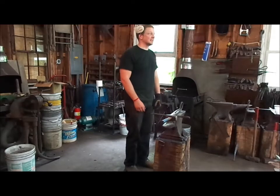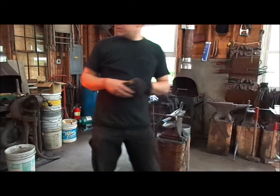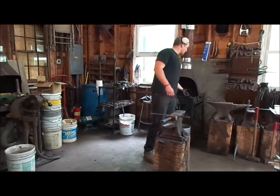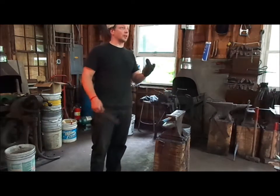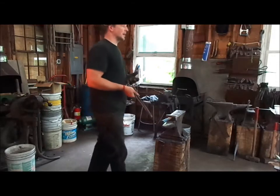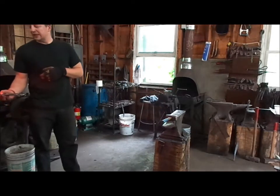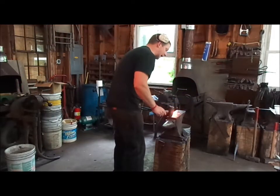Any more questions? When you say heat treating it properly — does that mean keeping it at the right temperature? Well, with something like wootz or other crucible steels, you do need to be careful about your temperature control during the forging process. Matt was running pretty hot just to make sure he wasn't stressing his welds too much. If you have what we'd refer to as a monosteel — say a piece of 1084, 5160, O1, or whatever — generally speaking you don't want to get the material too hot and very definitely don't want to keep it hot for a long period.